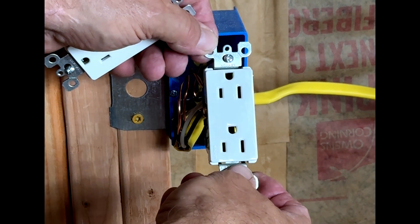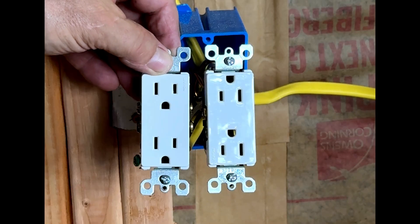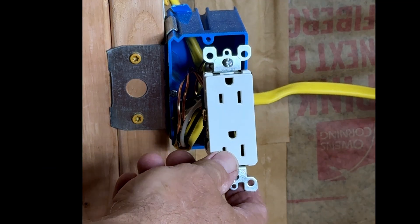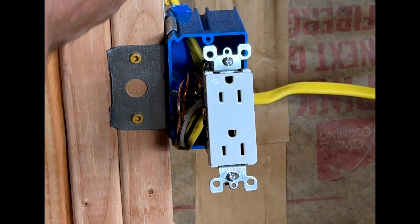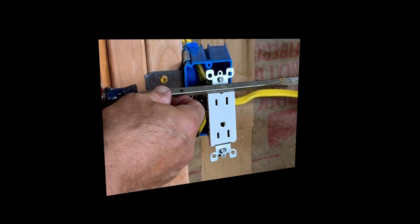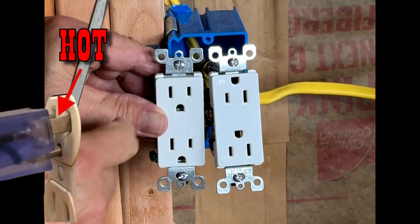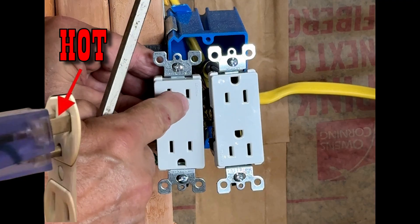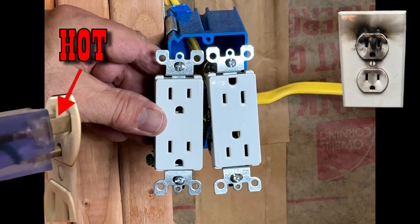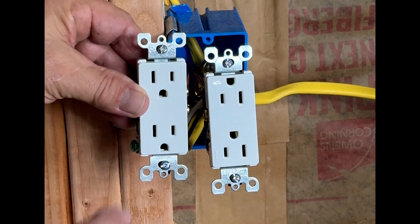Is this the correct way to install a receptacle, or is this the correct way? The funny thing is, this is actually the correct way. If you look at most commercial applications, they're going to be installed like this, especially in industrial environments. The reason is that if something slides down a wall and gets between the receptacle and a plug, it's going to hit the earth ground and ground out. If you install it the other way and the plug pulls back just a little, something slides in between — now you have your common grounding to your hot and you're going to be tripping breakers, damaging equipment, or possibly starting fires. So when you install, this is the right way, but in 99.9% of residential homes, this is what you're going to find.